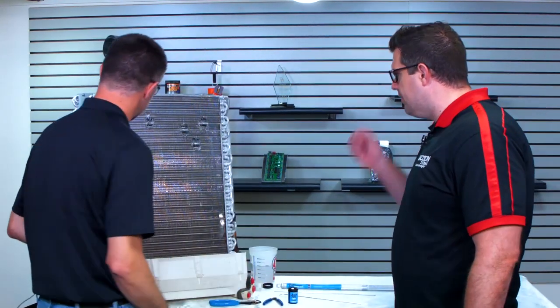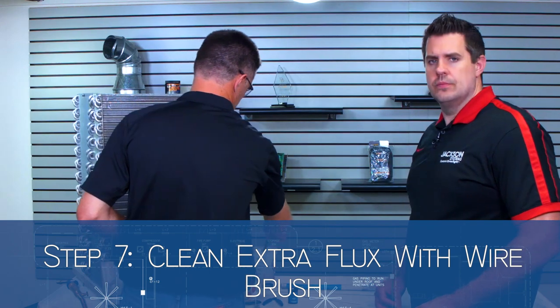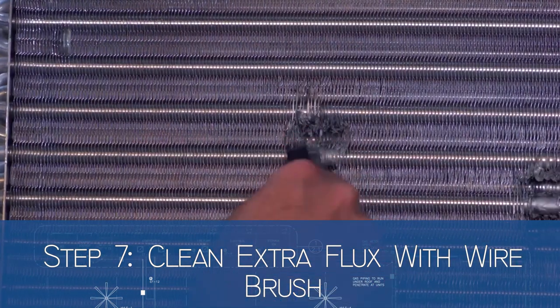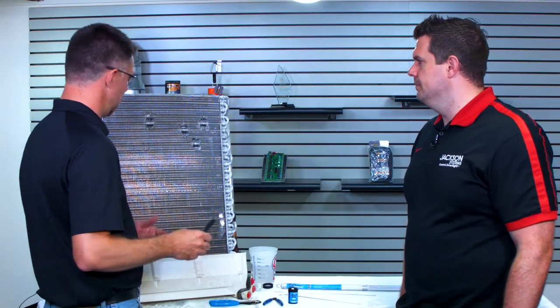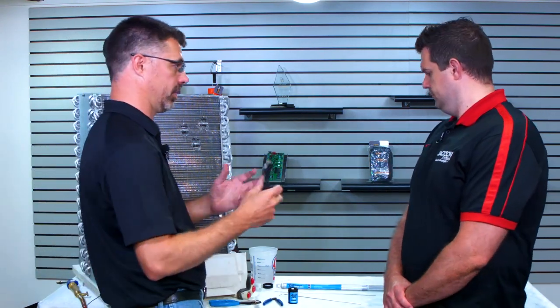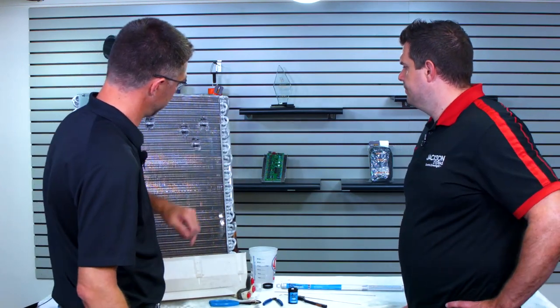The hole has been covered. Now what we're going to do is use the brush that comes in our kit — we're going to dip it in some water and just brush that off. Is that a time sensitive action? No, you don't need to quickly react. You probably want to wait just a little bit longer for better strength, to let everything cool out a little bit. The fins dissipate the heat away quite well because we have all this aluminum — these fins are designed to transfer heat, so they do a really good job of cooling it down fairly quickly. We're just going to brush that, get that flux off of there. Make a visual inspection and everything looks pretty good in there.